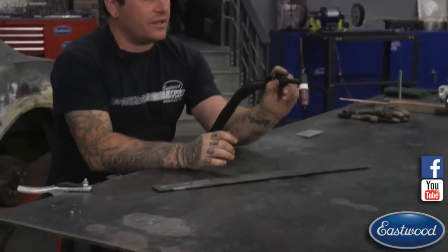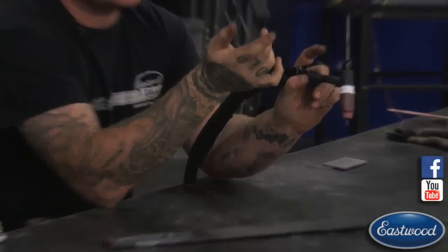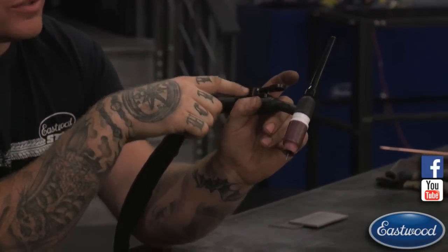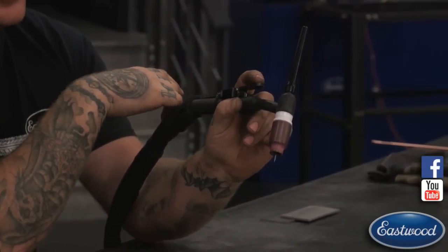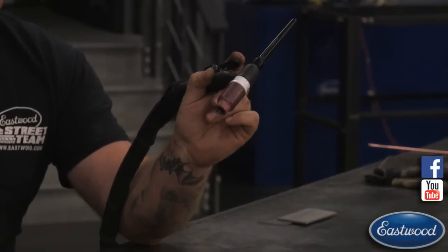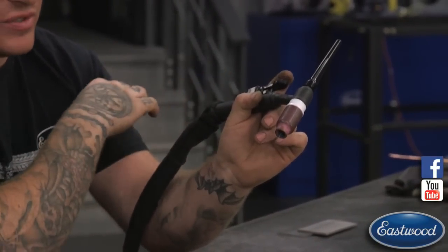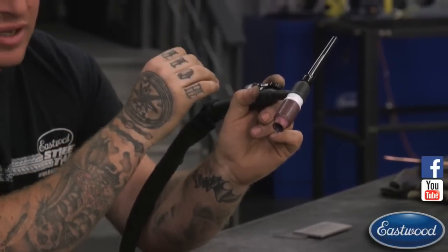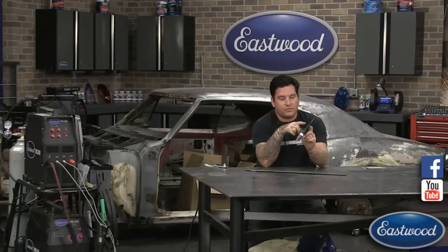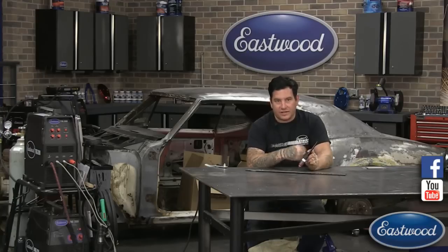Holding it like a pencil through this section here. We're using the Eastwood TIG 200 today, AC/DC model. Our TIG welders come with a little finger switch that is an on/off switch — if it's 110 amps, hit the switch and you go from zero to 110 immediately. When you're doing something where you need to vary the amperage using the pedal, I don't tend to use the switch as much. In those instances I just grip the switch as a handle — click it down and it's not going to do anything.